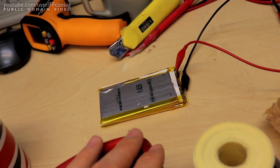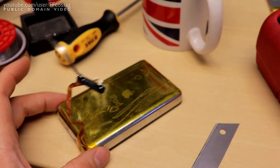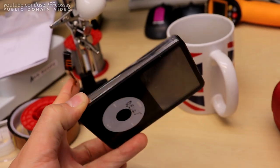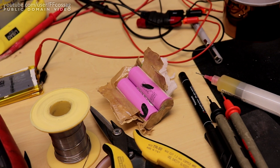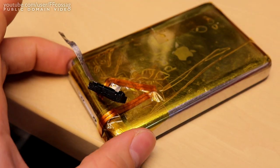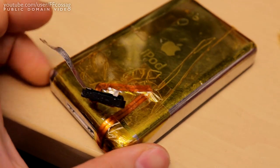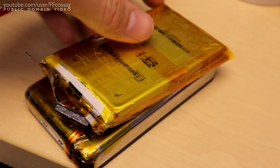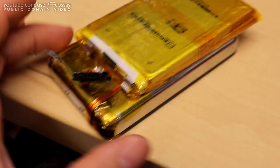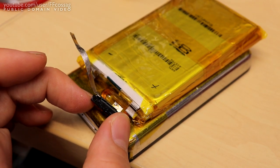What we're going to do is just tape them on here and turn this into a much nicer looking thing than it was with that thing piggybacked — it was all round and horrible and I'm frankly amazed it hasn't caught fire yet. I've now routed the original battery cable around the back of the iPod to put the BMS roughly where I want it, so the next step is basically just double-sided taping this battery on there and soldering the battery protection circuit straight on.